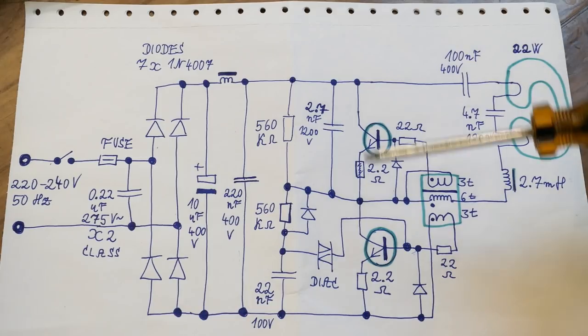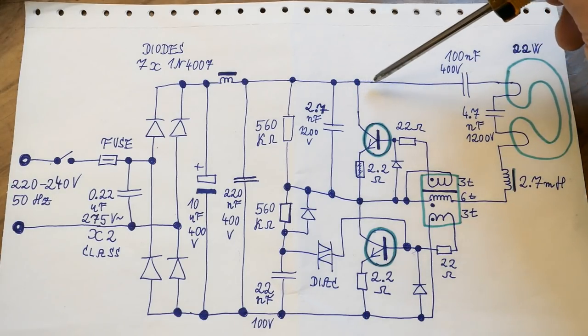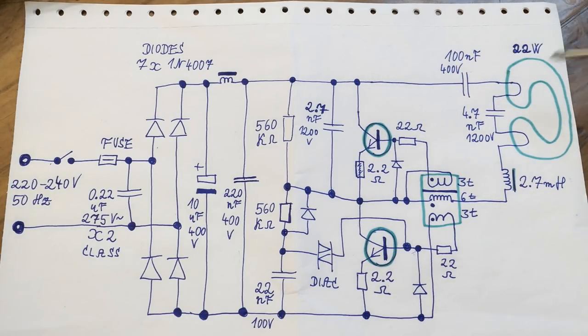And as it's oscillating, the high frequency voltage goes into the tube. There is a DC blocking capacitor, so only AC, high frequency AC, goes into it, and it has those heaters and this startup capacitor, which passes some current through the heaters to preheat them, and also this startup capacitor resonates with this inductor. When it's resonating, it increases the voltage to strike the discharge in the tube, and then the voltage drops to a lower level and the current is limited by this inductor.